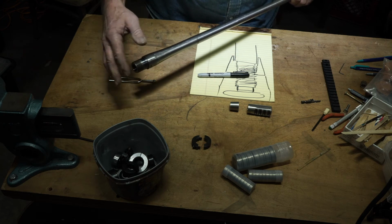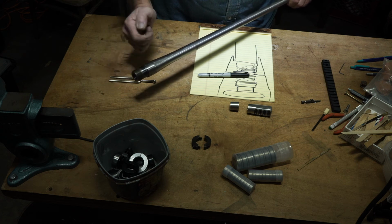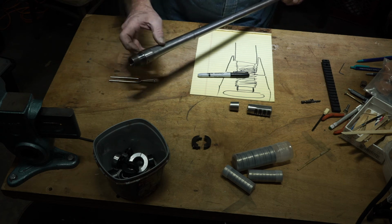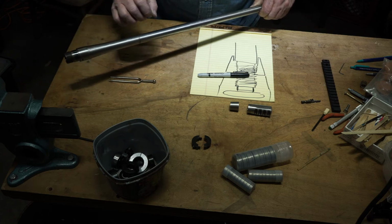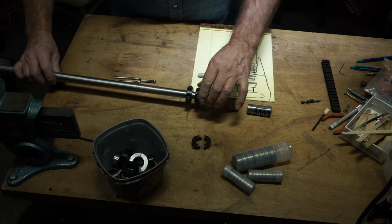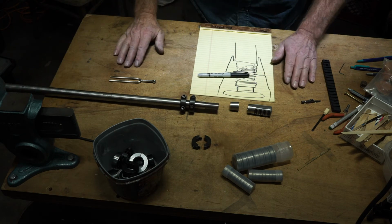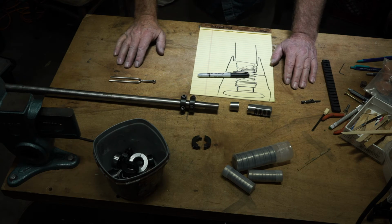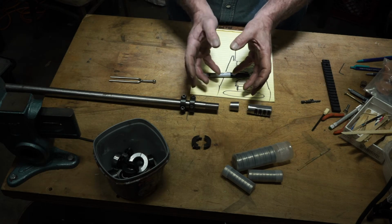This in here is literally just floating in space. But a Mauser's got a step here and a step here. This one's got a pretty good sized shouldering abutment, this particular barrel. But there's no reason. So what we're trying to do here is get things together tightly enough that under tremendous stress, they don't buzz, they don't shake.